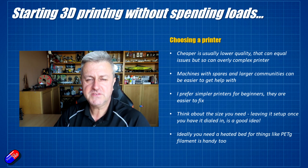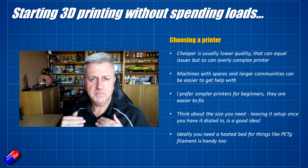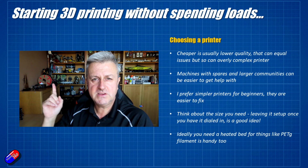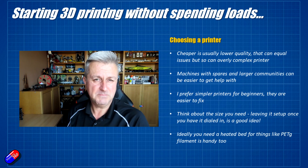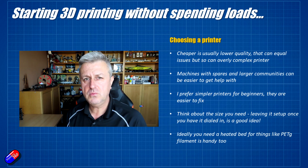There are only two things I would recommend for something like this. Do think about the size of the printer — ideally you want it somewhere that it can be set up and left set up. And secondly, I would recommend getting one with a heated bed, meaning the actual plate that the 3D print is printed onto can be warmed up as well. Now this is called an FDM printer — it deposits material layer by layer by melting plastic filament and eventually creates the thing you're after. There are other kinds of printers around like resin and others, but as a new person to 3D printing I wouldn't recommend going near those.